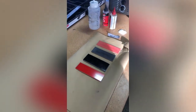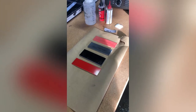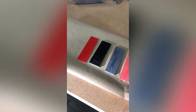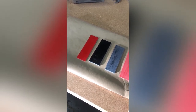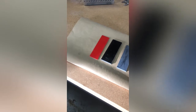This is how I'm going to show you how I glue up a G10 liner to a micarta, G10, or wood scale. What I have here is a raw G10 and a raw black micarta. If you were going to try to just glue these up they would stick, but it wouldn't be ideal — given heat, time, or shock, any of that could release the G10 liner from the scale.